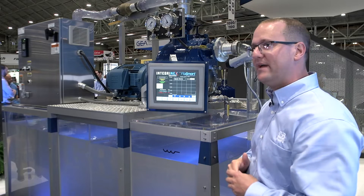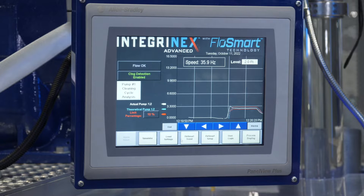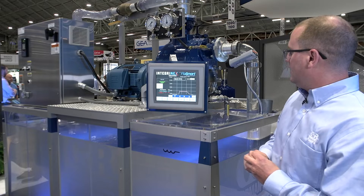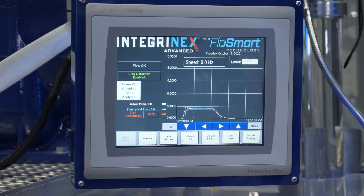It's hit two feet, which is our off level. At this point, the pump is going to reverse, loosening up that material. After a field-adjustable set point — some seconds or minutes depending on how long you want to run it in reverse — we return to a forward cycle and monitor the same condition to see if we return to the baseline set at startup. Notice we don't reverse at full speed; it's actually more effective at loosening material at a slower speed, and it's also a safety consideration. When the pump returned to forward operation, the white line came back within the limit percentage and the clog was cleared.